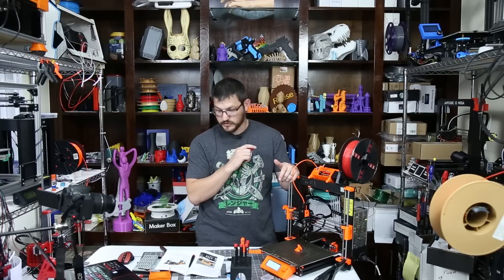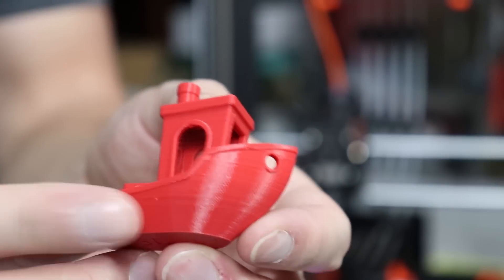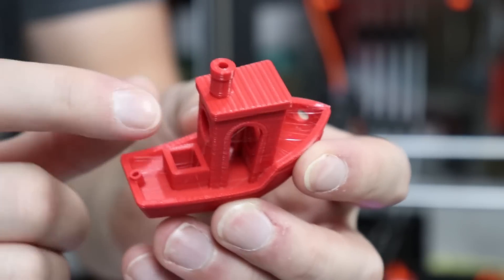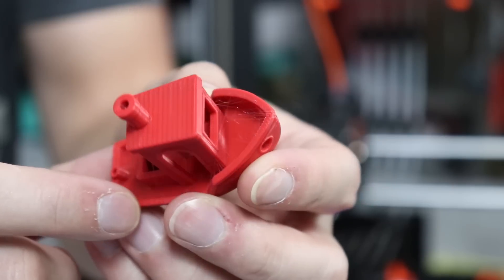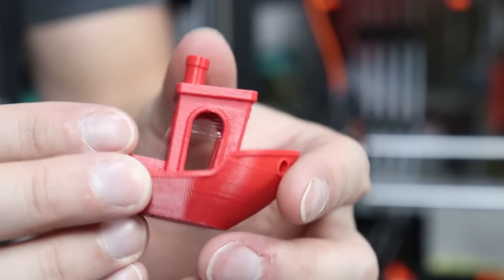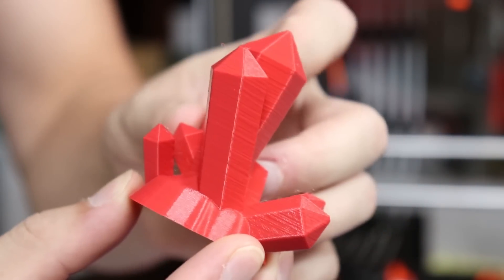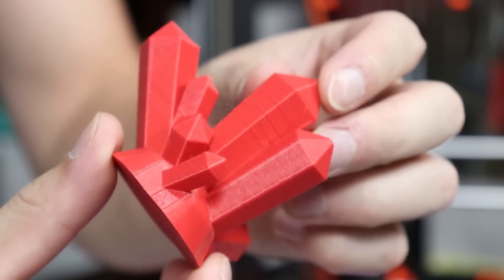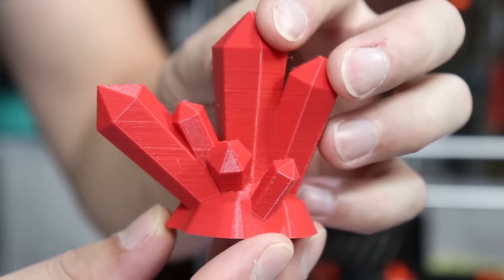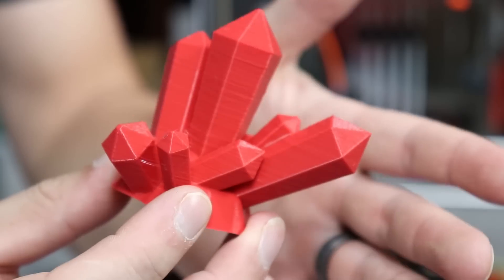Since doing that, I did a couple prints I'd like to show you because they came out just great. Here is a simple Benchy — the sample model that comes on the printer. I'd already loaded filament one, so it just started printing right away. It was a little bit hot using the US Monofilaments HH PLA, their high heat PLA, but this maroon turned out beautifully — really nice, just a little bit of wispies on it. I also recently found a gem formation model online. I printed it on my SLA printer and figured let me print it on this too so I can add it to the Thingiverse page as a make. It also turned out just fantastic — a little stringy from being a little too hot, but it stuck to the build plate no problems.